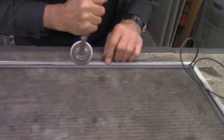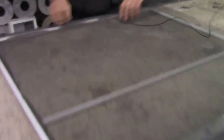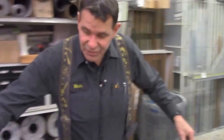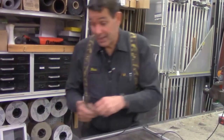Make sure the spline is driven all the way to the bottom. Now we can do the bottom rail — I pull my tacks back out because I'm going to keep the spline all in one piece. This spline comes in different diameters, so when you're rolling a screen, it's a darn good idea to take some of it to the store, because it comes in a multitude of diameters.